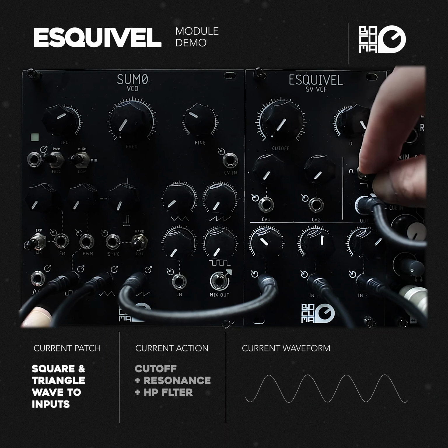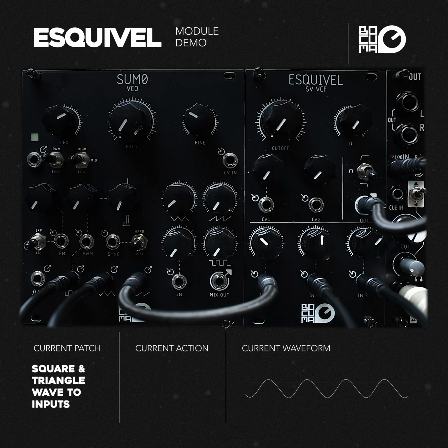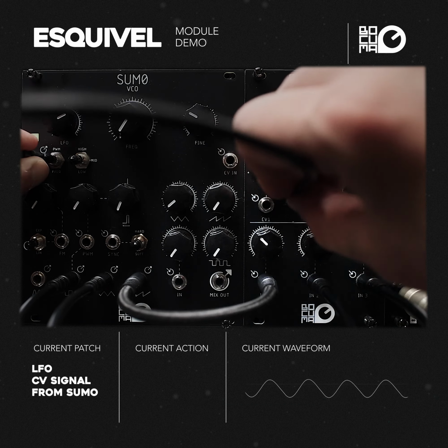Now let's have a look at the CV inputs. These two inputs have their own attenuator each and are routed to the cutoff control. Let's add a CV signal from Sumo's onboard LFO. Now we can modulate the filter action with an external signal.